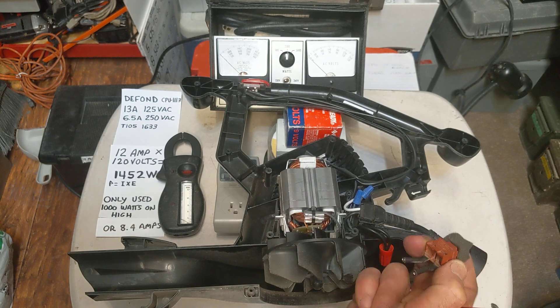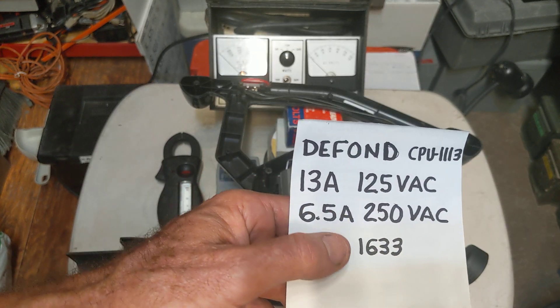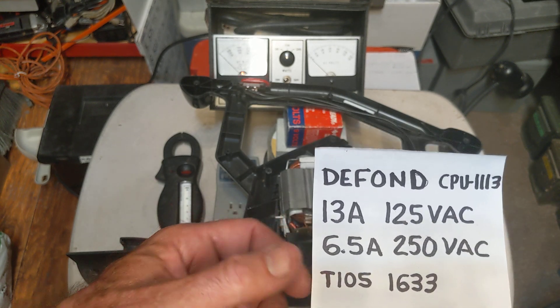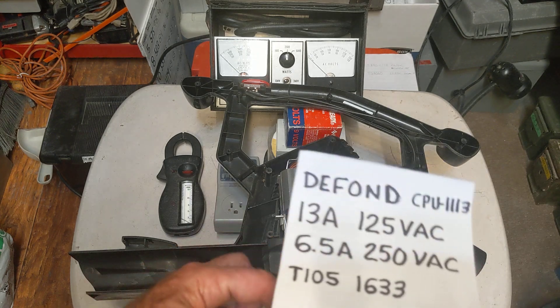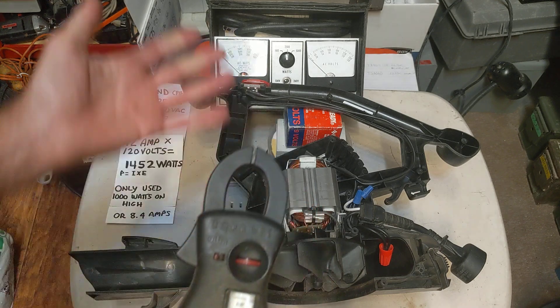This particular circuit breaker has ratings on the side — it's designed for 13 amps and 125 volts. So the first thing I wanted to do was find out if I was pulling more current than that through the motor. I decided I could put my amp meter on the line powering the motor and check it that way, or use my watt meter.